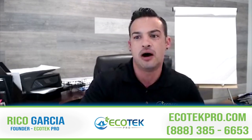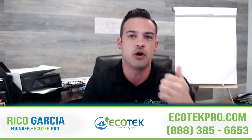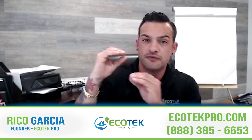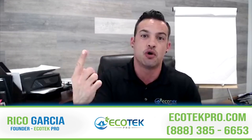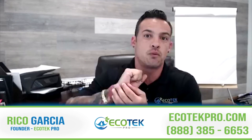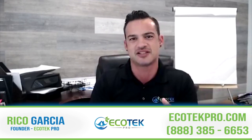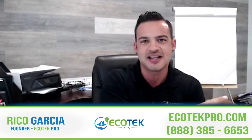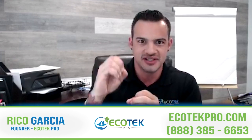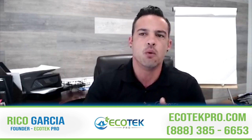Especially if you don't have a good filter — I made a video about what kind of filtration you should get for your home AC, so check that out on our page. But more importantly, if you don't have a good filter, that mold spore is going to go right through the filter, get sucked in through the coils, past the blower, and right back into the duct system — and eventually you're going to start breathing that stuff. The reason is it's moving so fast that the UV light may not necessarily have enough time to break up the mold spore's DNA.